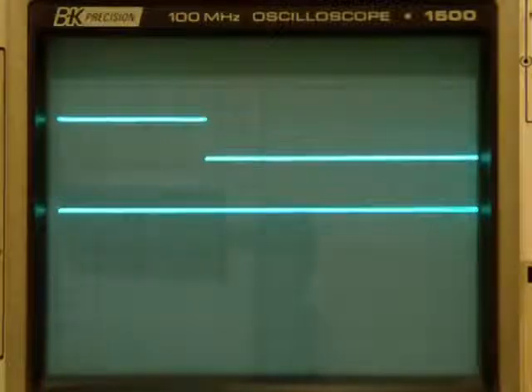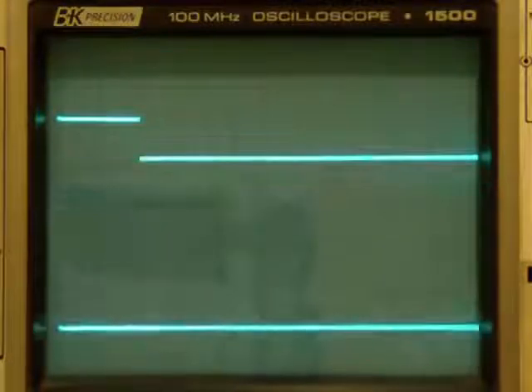This is a closer view of the pulse, and you can see the difference in the width of the pulse with the other signal changing. The skew control can actually change small amounts of that for a fine-tuned adjustment of the vertical and horizontal position. And there are controls on the bottom of these satellite receivers that can adjust that pulse width to the range needed.